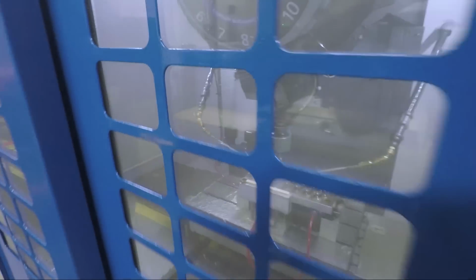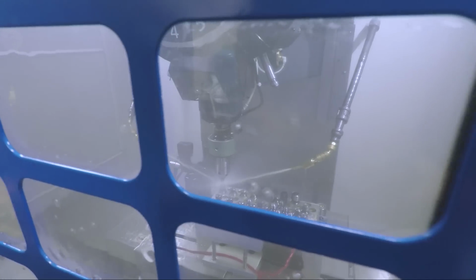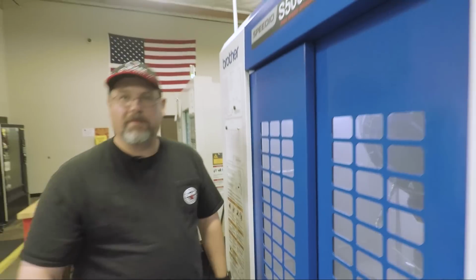Yeah, so these are all basically the same. That's all these machines do all day, every day. Wow. And so the balls are carbide, ruby, what material? Ruby, ceramic, silicon nitride are the three primary. Okay. And we do zirconia, sapphire, carbide, hard chrome steel. What's the hardest on a Rockwell? Silicon nitride. How hard is that?